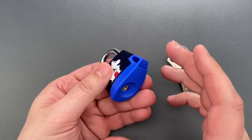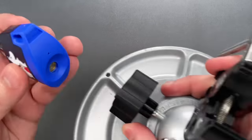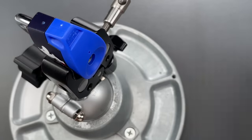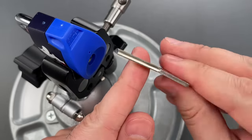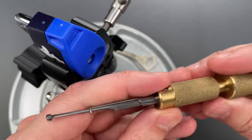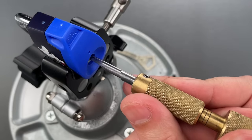If this was in the field, I'd probably need someone to hold the lock steady, or I'd just tape it to a wall, but for this video we're going to put it in a vise. The core inside is an Abloy Classic — it's a type of disc detainer core — so the first thing we're going to do is rotate all of the discs as far clockwise as they'll go. I'm doing that with a blank key. Then I'm going to get this tool, which I custom-made for these types of locks, and insert it all the way to the back of the keyway. We can then apply tension and get to picking.